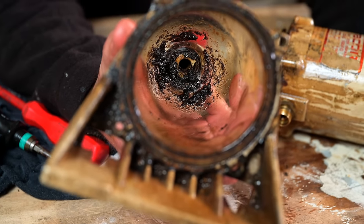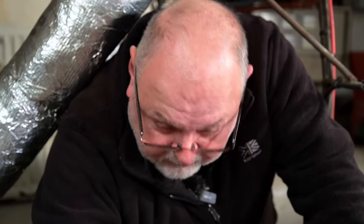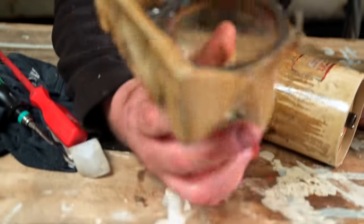That's got to come from the tank. Thankfully, this would have stopped that. To get further on, you're really into very, very fine microfilters. So this just stops the big chunks getting in, but that is a clear indication you've got rust in your tanks. Okay, fuel system, folks.